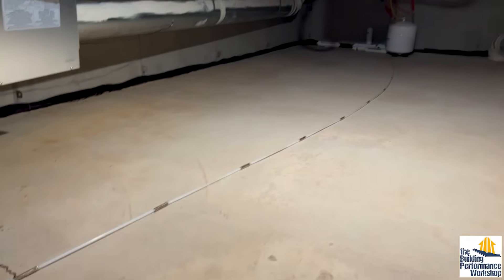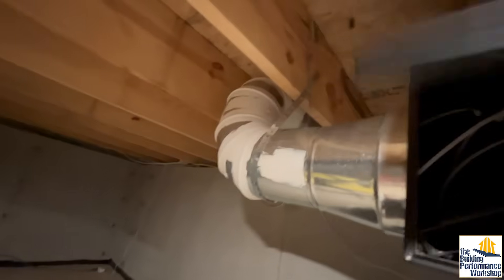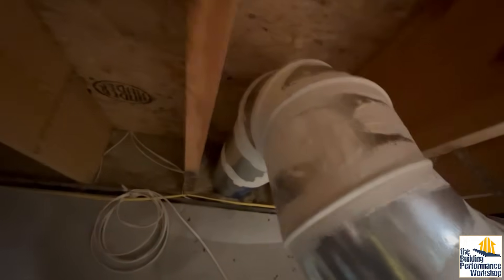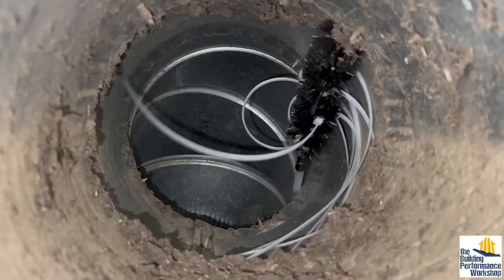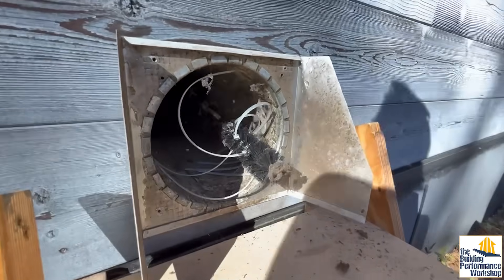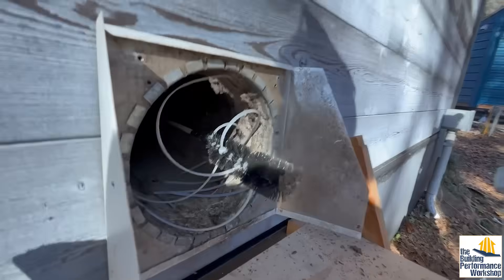It's coming along great — it's perfect. Disgusting. Whatever section we just hit, we found the mother lode of grossness. The filter box is going — whoa. That's where all of our fresh air was coming from. I'm just going to pitch the filter box — I don't think it's much good as an actual filter. When we got to the pre-filter box I had to go in at the filter box through the door, and it still works because we're vacuuming. I was able to get up and around both 90-degree turns. We just pushed the brush all the way up to the end until my helper said stop, then turned it on and pulled it back.